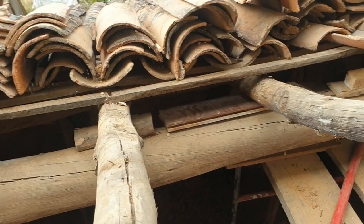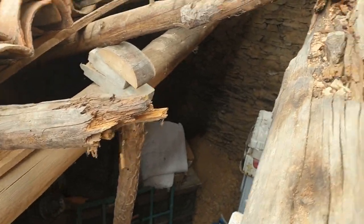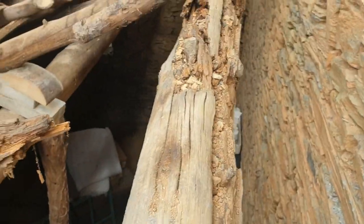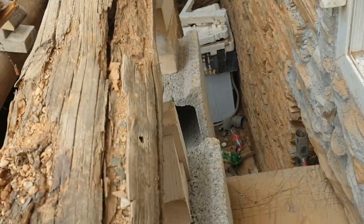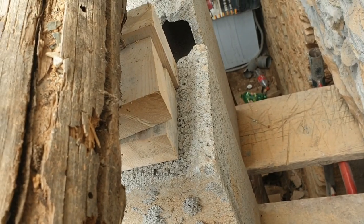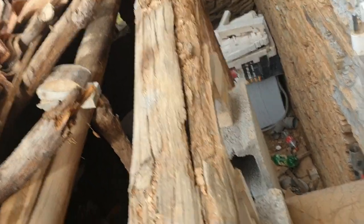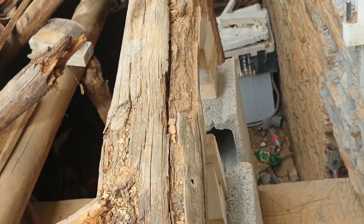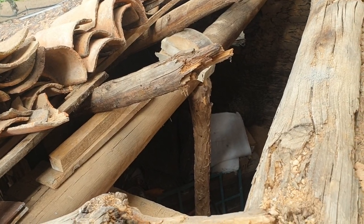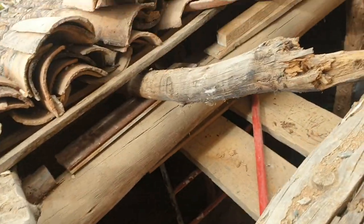I have all of the cross beams blocked up now up to this point. Some of these are nailed in as well which keeps the weight off, but what I intend to do is chop at that end — I've got it blocked up there, it's only going to drop an inch really, hopefully as long as it doesn't slide. I want to chop it off at the point where it's rotten. It should drop on those blocks and then I'm going to slice it up a foot at a time. When I come to one of these I'm going to chop the cross beams off as well.